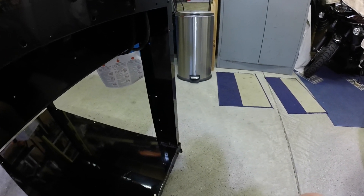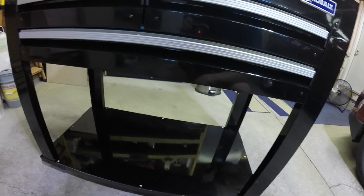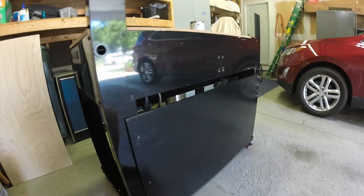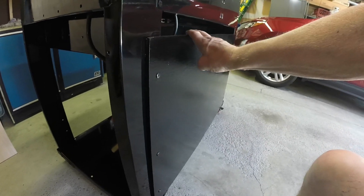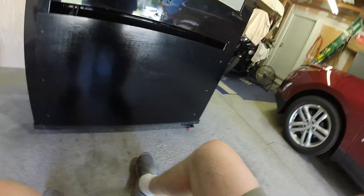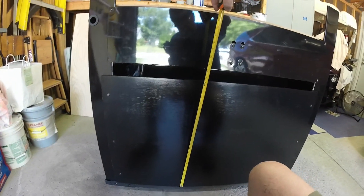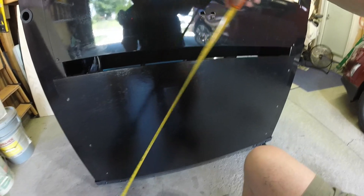I will go get my piece of plywood and briefly discuss the sizes. I've assembled the back panel. On the backside of the bench slash cart I have three-eighths plywood. This is about one of the only pieces of wood I needed to buy — most of it is leftover scrap. The back panel I started with a two-foot by four-foot piece of three-eighths. That size does not need to be trimmed in width.